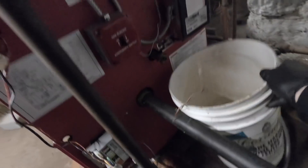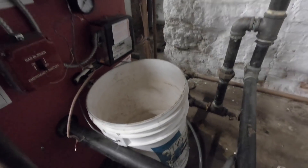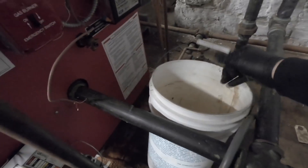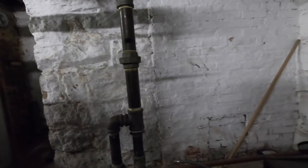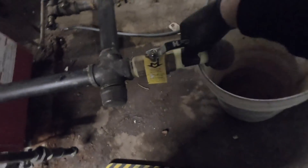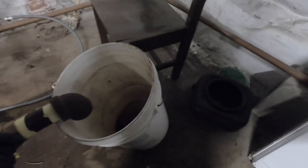So now we're going to flush this. It's okay if I go like this — usually it helps hold it right under so as it flushes it comes in. Let me flush a little more through the boiler. What I want to do is get some water in the boiler and then drain it down — the whole return's got to fill first. I'm filling the return right now; once that return is full — piping goes all around the building — then we should start getting something out of here. Now I've got the return full, so let's get some water in the boiler.